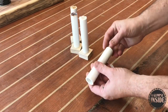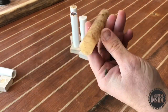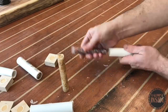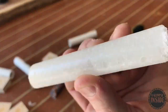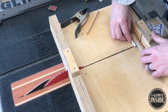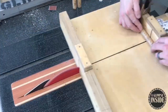Now it's time to prepare these blanks. I'm actually pleasantly surprised because the blanks are coming right out of the PVC pipe. In the past, other resins I've used adhered to the PVC and I had to turn the PVC off on the lathe — this looks like it's going to be better. Over at the crosscut sled, I'm using one of the brass collars painted white as a reference mark to cut these blanks just a little oversized.